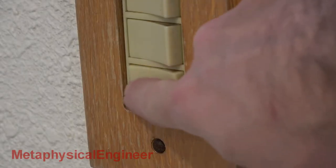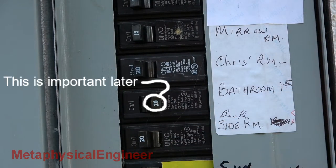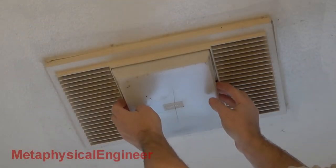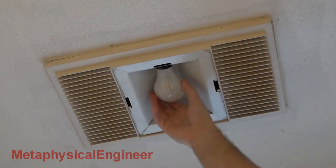The switch for the heater isn't doing too well either. First, find the breaker and cut off power for extra safety. Thankfully there's labels. Then become tall. The cover for the light has a tab on each side — squeeze and pull to remove. Unscrew the light bulb and put it somewhere safe.